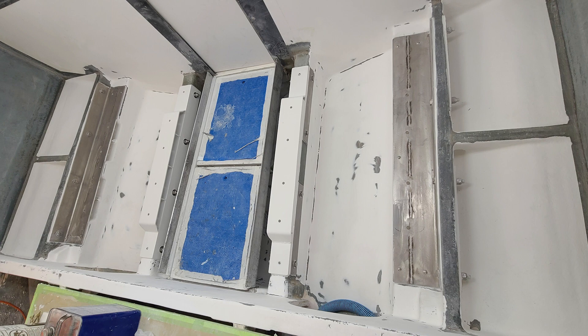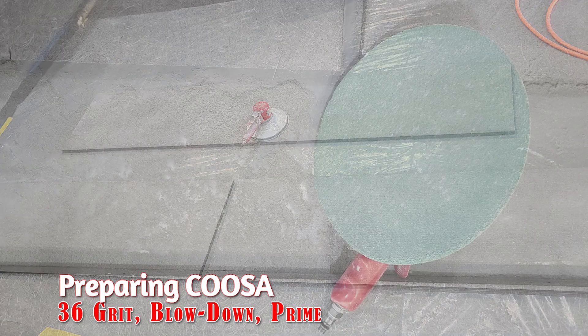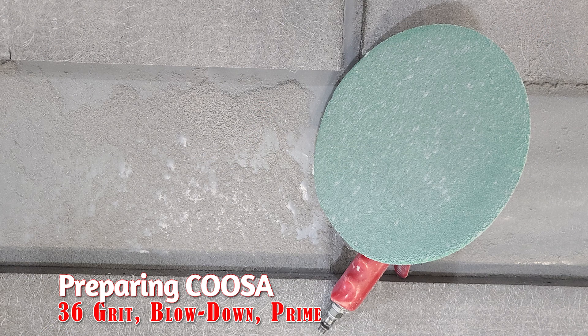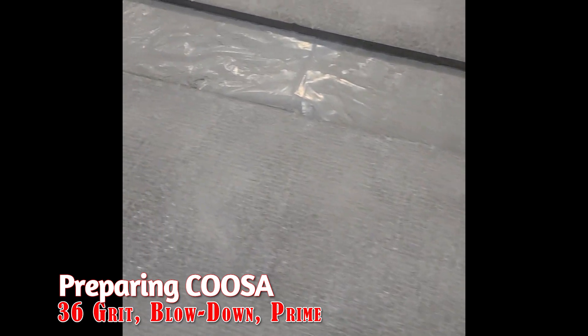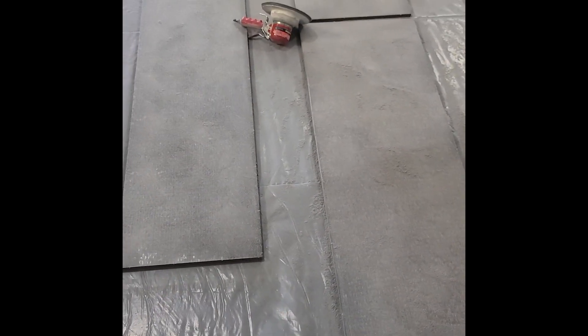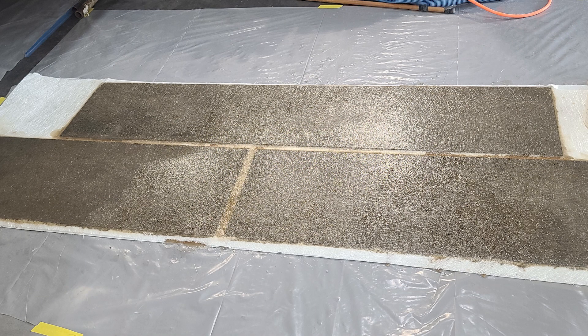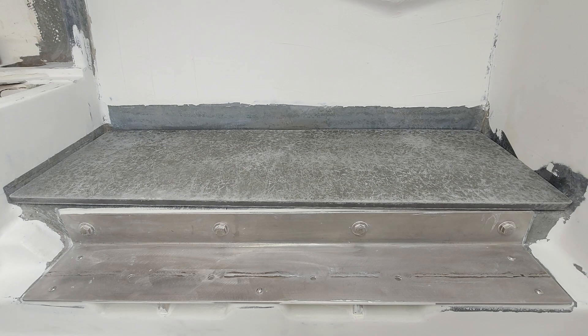The engine beds were just installed. These are the platforms inside the engine room and the rudder shelf. Obviously they don't look like much right now, but they will become the platforms in the rudder shelf. I take preparation very seriously — this is proper preparation and planning, prevents piss poor performance. These are properly prepared, and there's the primer. That would be a three-quarter ounce skin on the panel, really just to give them some stiffness. Those platforms are just fitted into place.